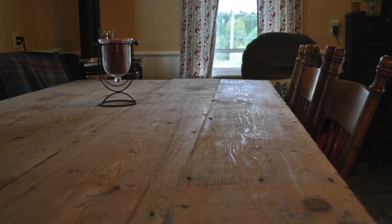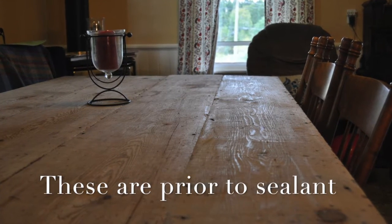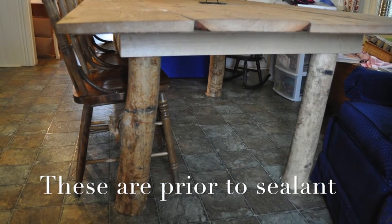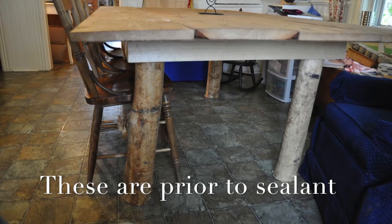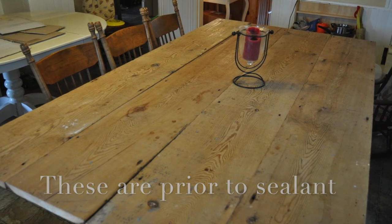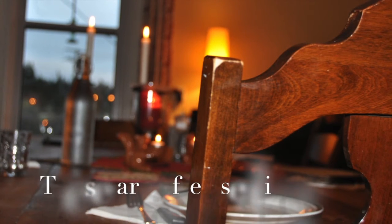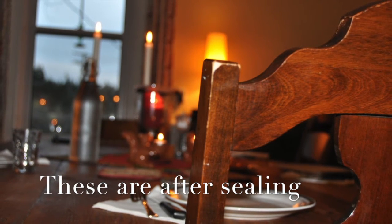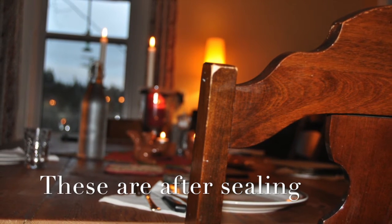So how has the beeswax sealant worked to date? It's been about 2 years, maybe almost exactly, since I built the harvest table and sealed it with the wax sealant. I have recoated it 2 or 3 times now. Every couple of months I just kind of clear everything off, give it a good wipe down with a warm, damp cloth just to get the food or whatever is on there. And then slather some beeswax and olive oil, the sealant, all over it, and let it sit there for a good 18 hours, 24 hours if I can, and then I just wipe the excess off it. I just do the top because the top obviously is the surface that's wearing the most.